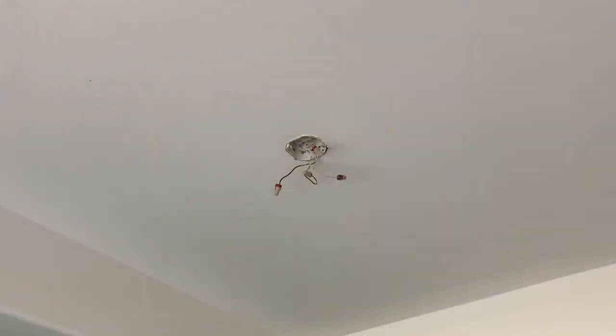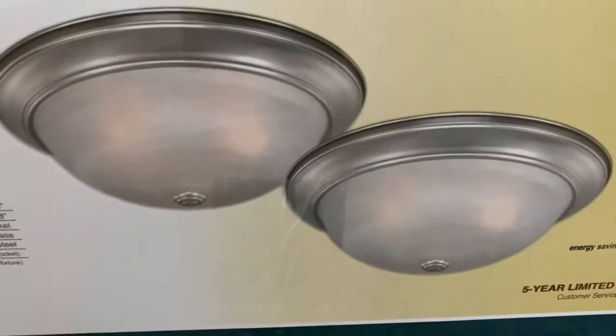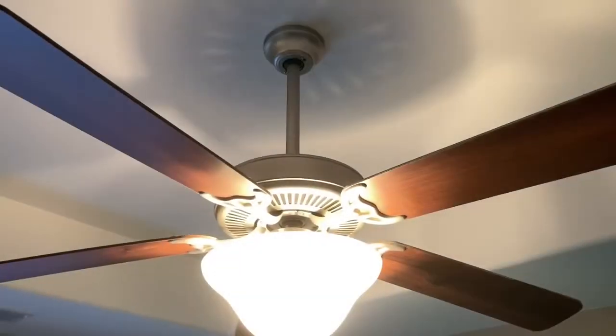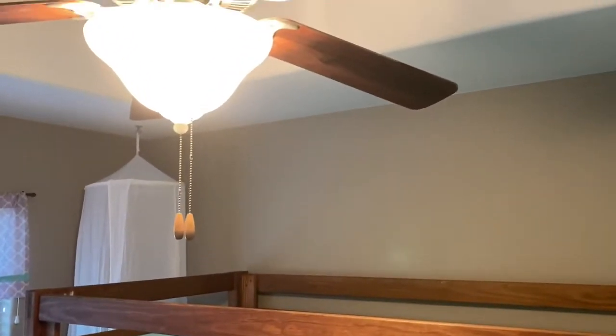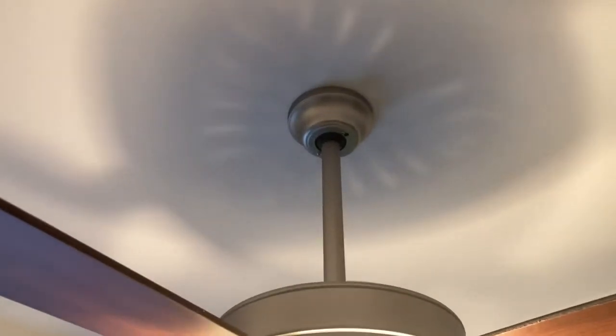So definitely a do-it-yourself job. In this particular case, since I'm dealing with kiddos and bunk beds and fans, I'm just going to replace it with a flush mount ceiling light like this one. I'll do a separate video on how you can install this. But that is basically how you take down a ceiling fan like that, or at the very least shorten up that down rod in a do-it-yourself way. Again, you can buy your own down rod if you're not in a big hurry, or you can cut it down to size. Now be careful — you might void your manufacturer's warranty if you do indeed do that, but it's a nice little trick if you are in a pinch.